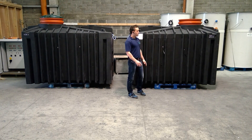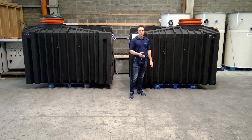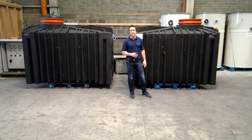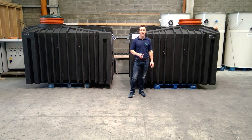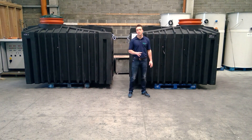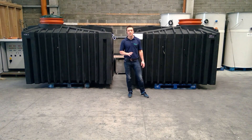From an installation viewpoint, you obviously need to prepare your excavation with a level base, ideally with a bit of rounded pea gravel or 804. For the surround to go around the tanks on backfilling, again you want to use rounded pea gravel, shingle, 804, or sand. You don't want to use any large sharp angular gravel, and you don't want to use the soil that you excavated on site. You can put a concrete backfill or a lean mix backfill around the tank if you wish, but it's not necessary.